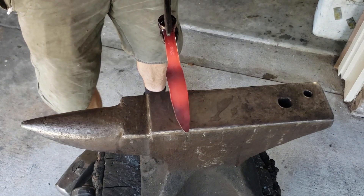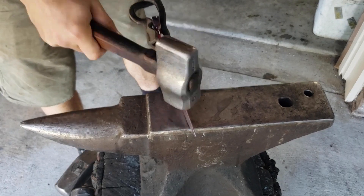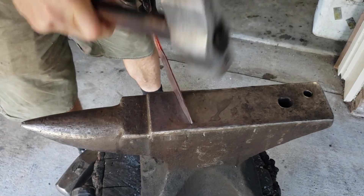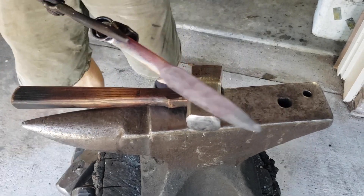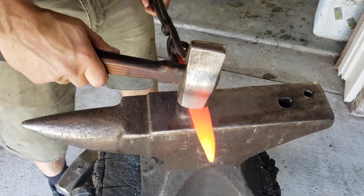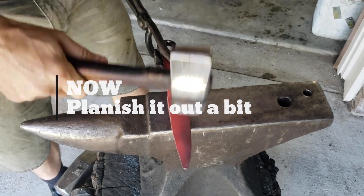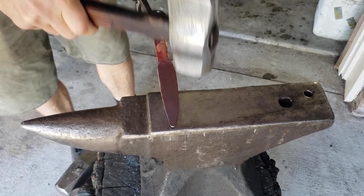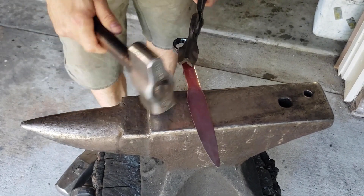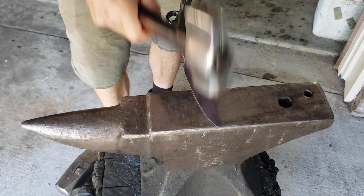At this point, just finessing some of that blade shape a little bit, truing it up, doing as much work with the hammer as possible. This is careful forging so I don't bend over that tip or that edge and curl it. Just keep it light, keep it even, keep it under control, and then smooth it on out when you're done with the main forging. Make sure you've got a nicely forged, finished blade.